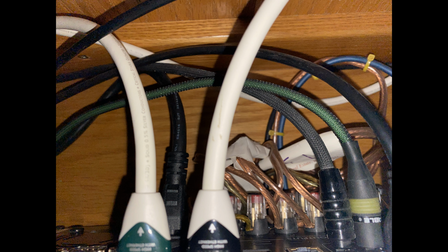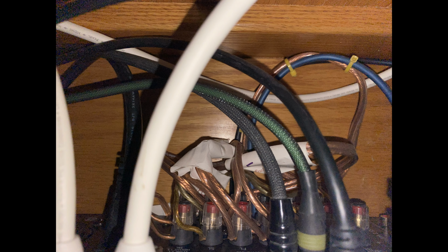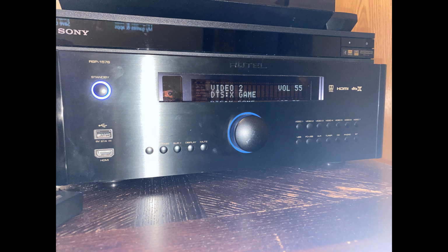First off, with separates, you're gonna need more space and room to run all your RCAs or XLR cables along with your speaker cables. For the power amplifier, if you're gonna put it on a rack, it has to have a high enough clearance space to anticipate extreme heat, and a minimum of 4 inches around the back of the unit is recommended by the manual.